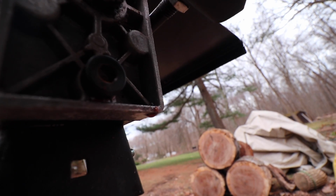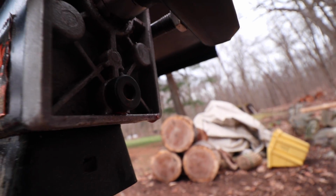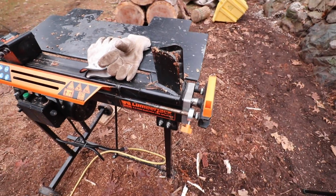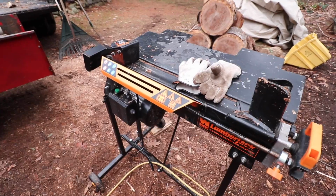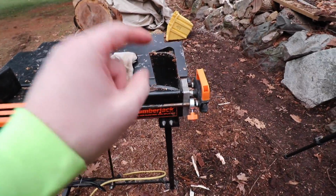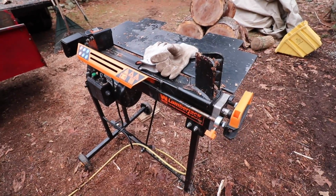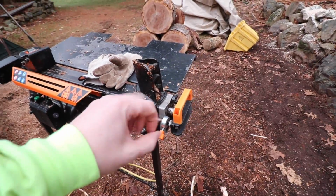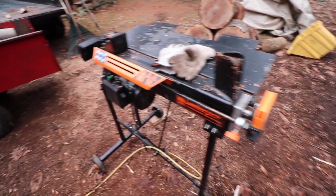Also, underneath that piston, see there's a little Allen head. It's kind of dark, I know, but that is where you fill up hydraulic oil. Now, if you're in a cold weather climate like me, the instructions say to fill this up with Dexron ATF. And I actually did have to add probably half a quart to this hydraulic system for the first time today. So I'd imagine it's a cheap piston. Maybe the seal's a little bit leaky. Maybe they didn't fill it up completely from the factory. I'm not 100% sure, but rest assured, if you get low on hydraulic fluid, just add a little bit of Dexron ATF. And there is a dipstick attached to that Allen head bolt, and then you just have to make sure that hydraulic fluid is within the two lines on that dipstick.